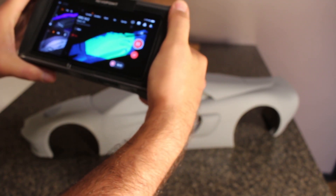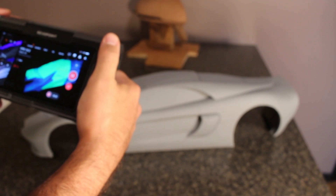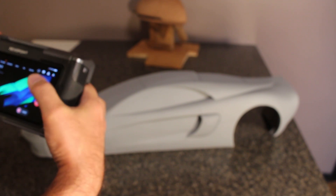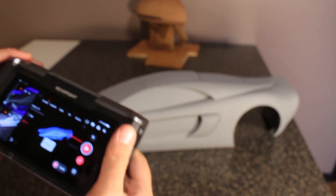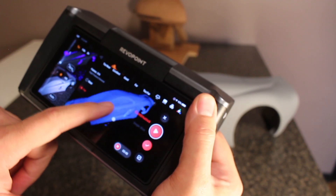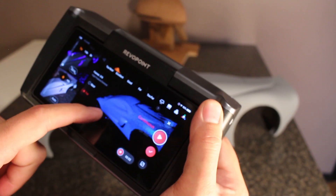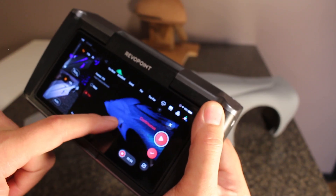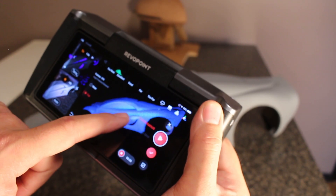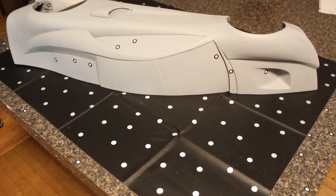This is my first scan of the car, done in near mode — or actually this might be far mode — but it didn't have a point of reference. A lot of the panels are very flat, and there are some weird anomalies that occur when the scanner gets lost because it recognizes flat areas as the same areas as other flat areas. So this is what I ended up doing.